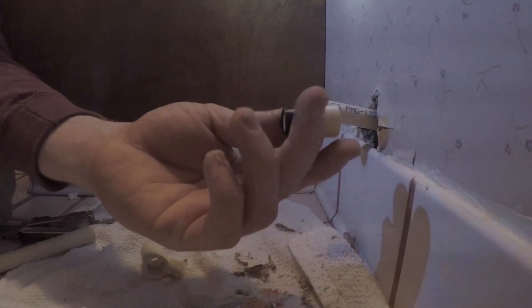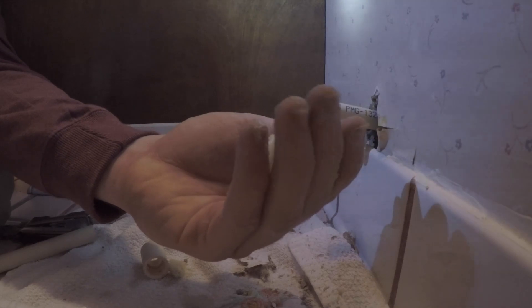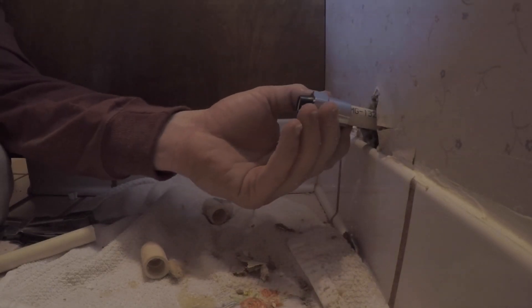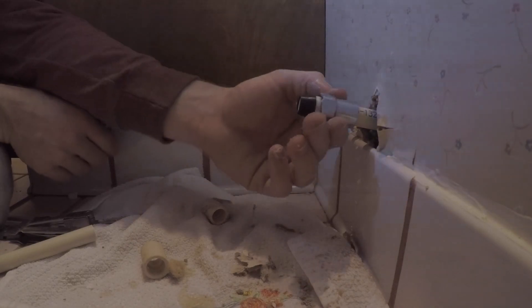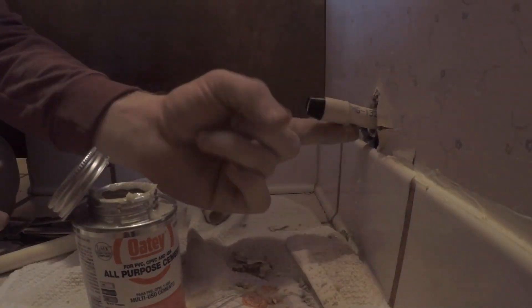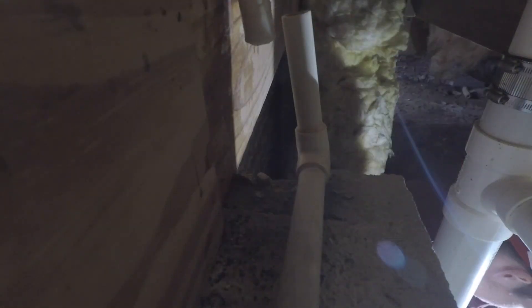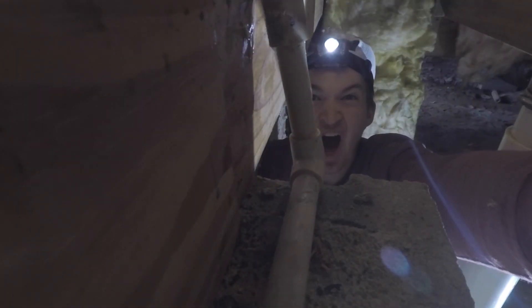So if I ever have to do this again it won't be that hard. This is the little piece that came with the shutoff assembly — you actually have to put this on first. Don't glue this on before you put that on; I almost made that mistake just now. This will then slide up and we'll be able to screw our shutoff valve to that. I'm back under the house and now I'm going to connect this pipe to this one with a coupling.